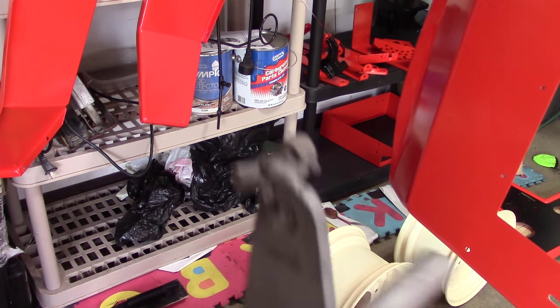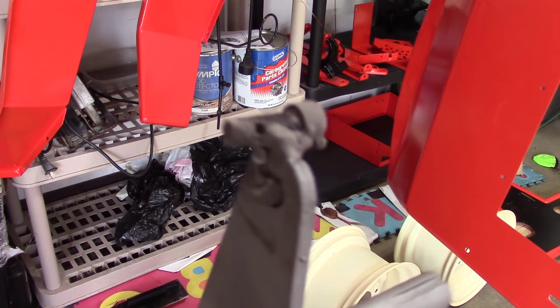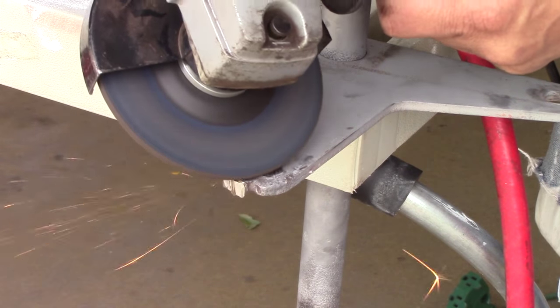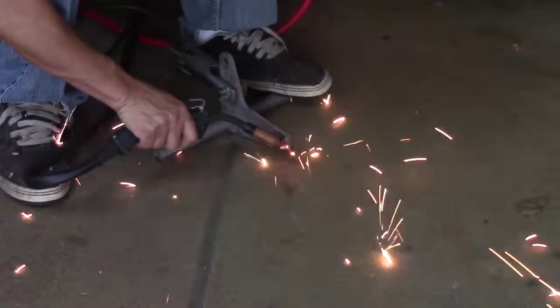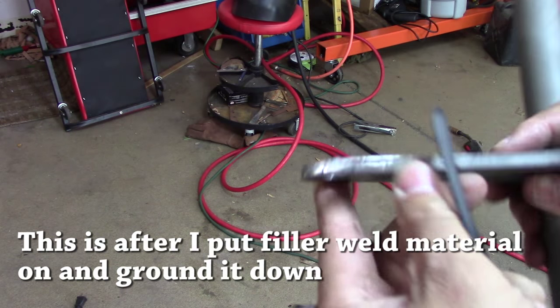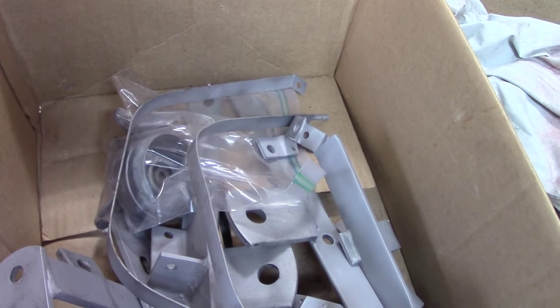It's time to attack this little part that my dad did. You can see where the original hole was — I'm not sure exactly why he did that, but I cut that off, weld it up, and get it re-drilled. I used my press to punch out that piece that was welded into that middle hole. It's not perfect, but that didn't turn out too shabby — once it gets painted you can hardly tell the little flaws. I thought I only had those few parts to go, but then I found a forgotten box of parts, so I re-sandblasted them. I'm in the scramble to try to paint before it gets too cold. Here's that part once it got sandblasted — turned out fairly decent, not too shabby.